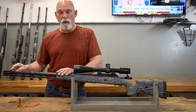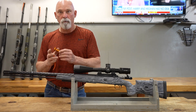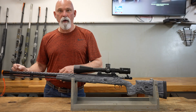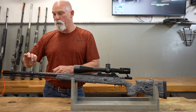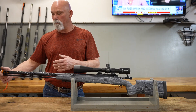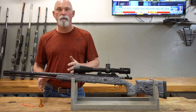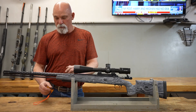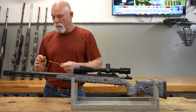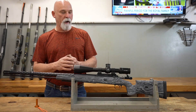We have one of my self-timing tactical style muzzle brakes on the end, bored out and ready to go to accept this loading funnel. It goes right into the muzzle brake and stops 20 to 30 thousandths before it hits the crown of the barrel. You pour your gunpowder in, put the bullet through the funnel, do all the loading through the funnel, and then once you've rammed your bullet home, you pull the ramrod and the funnel out at the same time. Try not to shoot your funnel — I've had guys do that. That's why we have them anodized bright orange and they come with an orange lanyard, so you can visually see the funnel if you got distracted and left it in there.